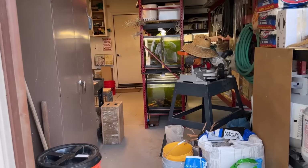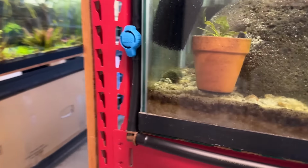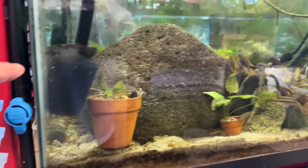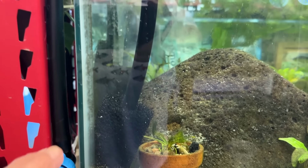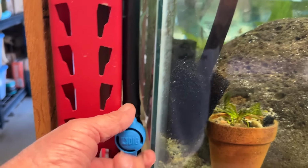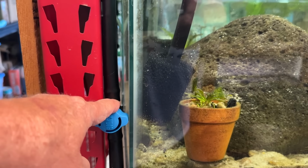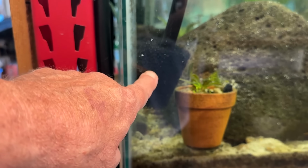And that final outgoing valve down there, what that's for is that it's going to keep water in the line. Now, each one of these individual tanks, once water is run through this pipe, I'll hook up the garden hose down at that end, and flood these pipes, and it'll push water through here and out here. All right. And then once water's coming out here, I will turn this valve to the off position. Now, from now on, unless something happens, this pipe will have water in it from here all the way into the tank.